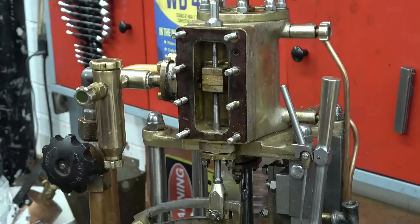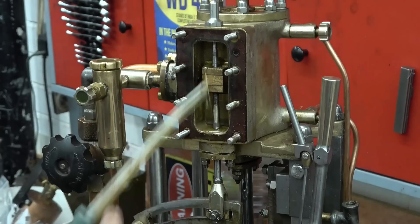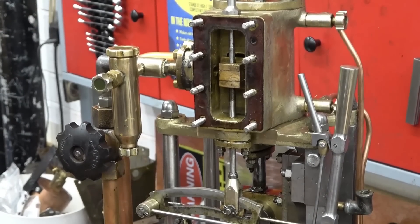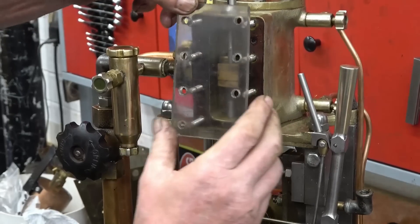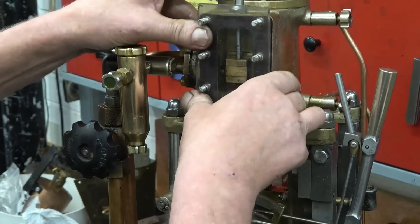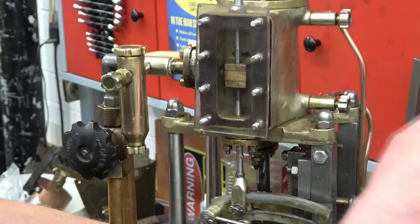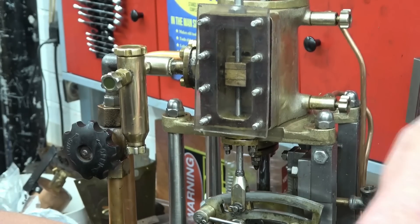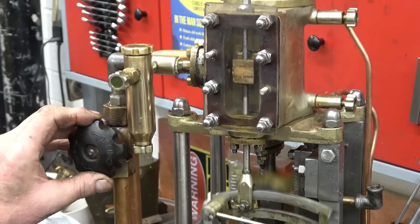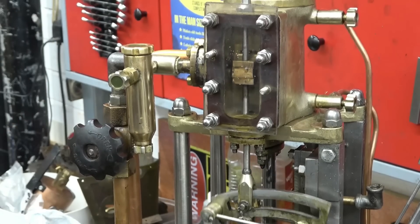The chest is bronze but that push rod is silver steel and it would corrode. What I have got is a piece of perspex that I made ages ago to show how the valve worked — I can put steam or air on it and you'll be able to see how the valve works. I'll clamp it in place without the nuts and you'll be able to see the valve moving up and down as the engine actually runs. You can see the valve working — covering the port. The top one's the top side of the cylinder, the bottom one's the bottom side, and the exhaust is in the middle. Really clever the way it works.